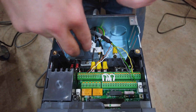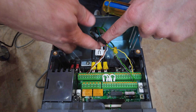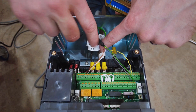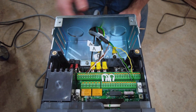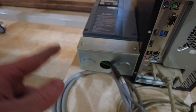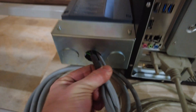Now I'm just going to confirm they are wired correctly. Our first one is U, the next one is V, and then the last one is W wired up there. We've got our ground — I think we're good there. The cable coming off the cable chain wrapping around to our VFD is now wired up: U, V, W, and ground, all coming out of this cable.